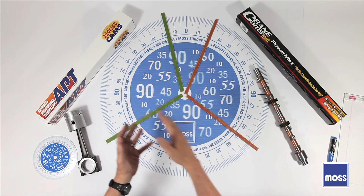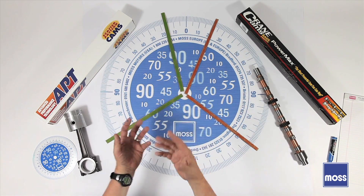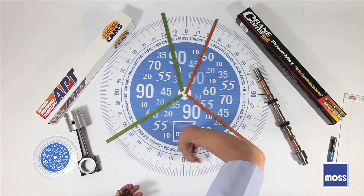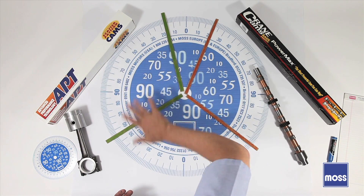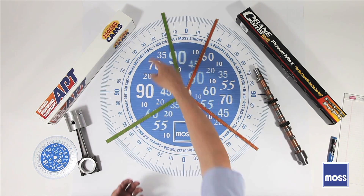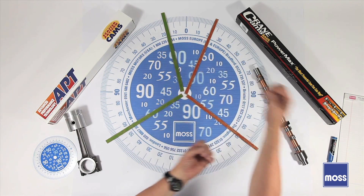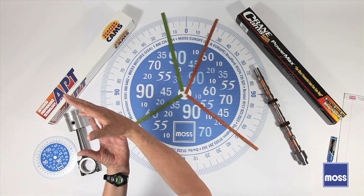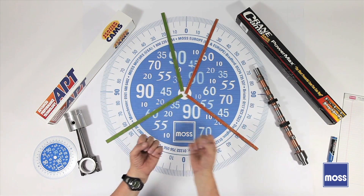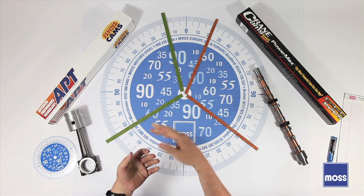Now the other thing — imagine we're going very, very slow, like at crank speed. The piston has gone down, there's been a bit of a burn in there, and we've got extra fuel because they were pumping on the choke trying to get it to go. The piston comes up and is trying to pump out the exhaust, but we still have burning vapors in there. The exhaust valve is still open, there are burning vapors in the exhaust, and now my intake valve opens. What's going to happen? There's no flow, no inertia to push this out the exhaust system. So it burns its way out through the intake valve and the carburetor goes bang. That's why when they're trying to start these engines, they have so much trouble.